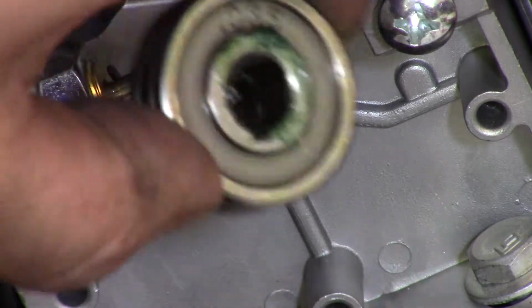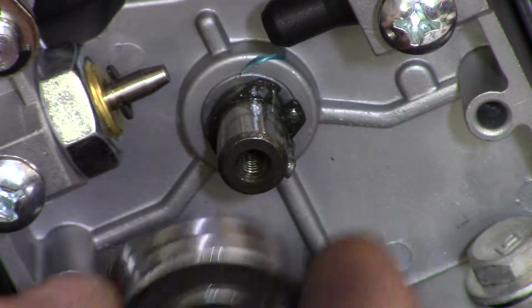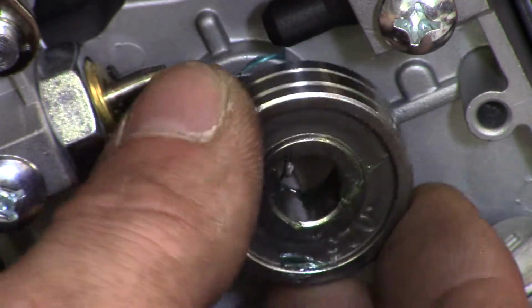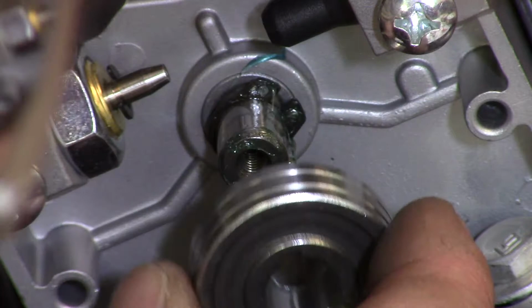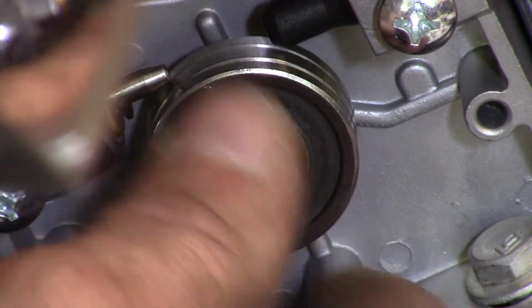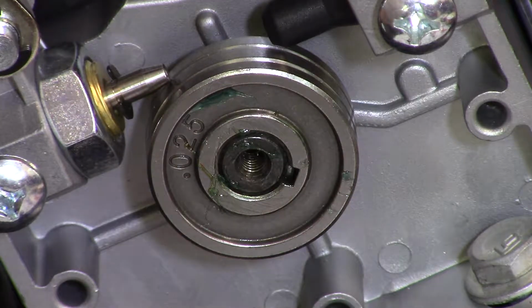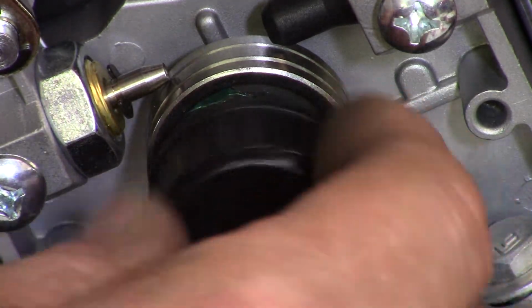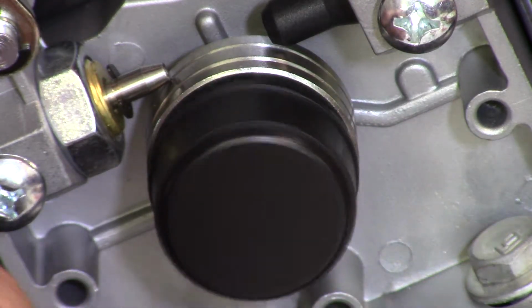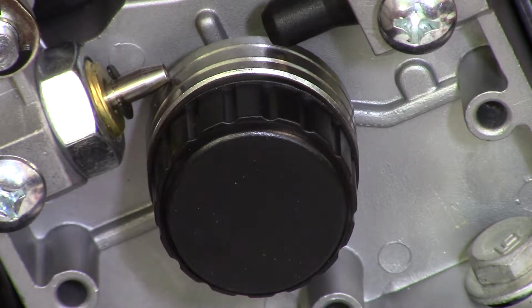See, there's a little grease on there. I'm going to flip this over so it comes up 025. If you don't do this, and I've actually run into this problem in the past, if you try to run too wide or thin of a wire through the guide, it screws up. It just causes more problems than it's worth. It only takes a second to change it.